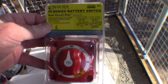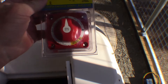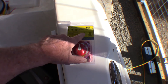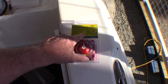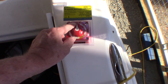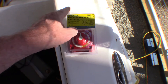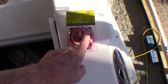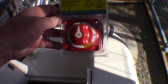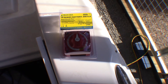This is the special isolator switch that I've got to go with the new battery setup. It's different from normal isolator switches in that it keeps two batteries completely separate, and when I turn it on each battery is on its own circuit. We've got an engine battery and a house battery on their own circuits, but in an emergency I can combine the batteries. So rather than being one, two, or both like most isolators, it's engine on its own, house on its own, or combine them — and then I can use them to start the engine if the engine battery happens to be a bit flat. It's a special unit for a special job, and together with the isolation circuits and the troll bridge it's going to be my complete battery setup.